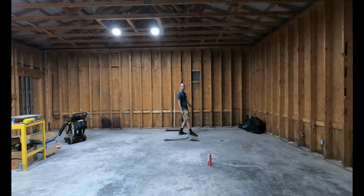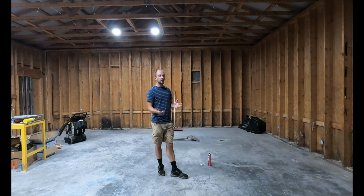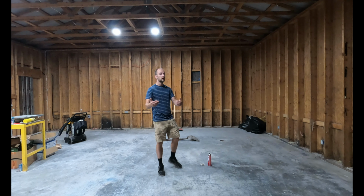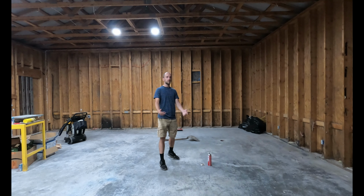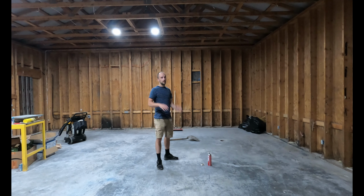It gave me plenty of room to bring a tool in here. I wouldn't really have to worry about hitting the truck or anything else. And then I also looked at the spacing behind the truck and where that would meet the garage door. So my thinking is, since asymmetrical lifts put 30% of the vehicle in the front and 70% in the back, probably if one percentage is going to change, it's going to be the percentage in front of the post. So maybe it's more like 35% in the front and 65% in the back. So I'd rather give myself a little extra room in front than in the rear.